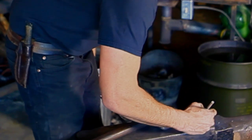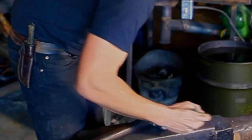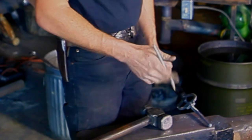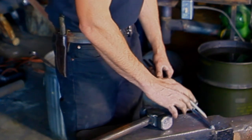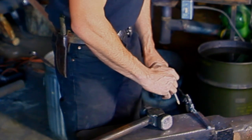I'm going to grab a silver pencil and measure from the shoulder of the ball to where my taper stops, then make a little mark on my anvil. That way when I do the next side I can make sure it's even. Next heat we're going to round out this square taper.